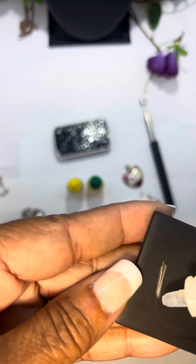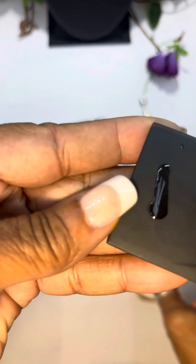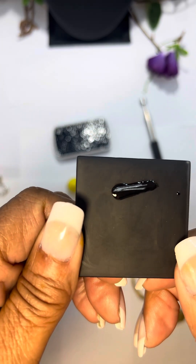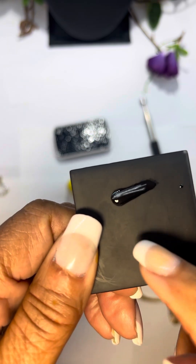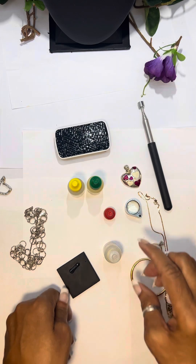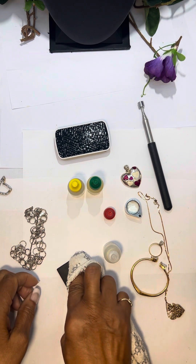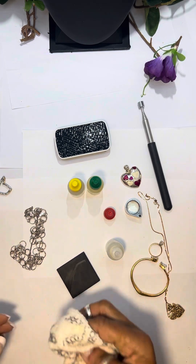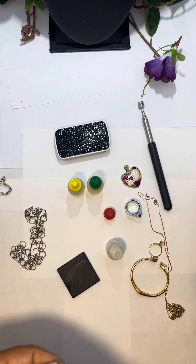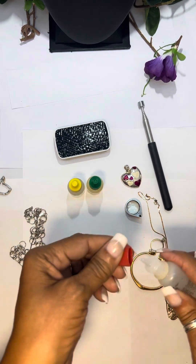Using the 18 karat solution, I just sweep across the scratch like this. And if you notice, you see that blue iridescent color that comes up — this is sterling silver. That's what you look for with the 18 karat gold solution: that blue iridescent, light blue color. It's going to come immediately once you put the acid on it. It's that simple.